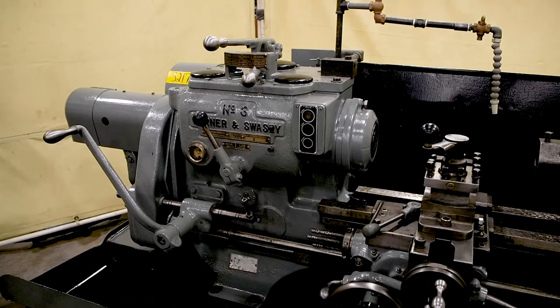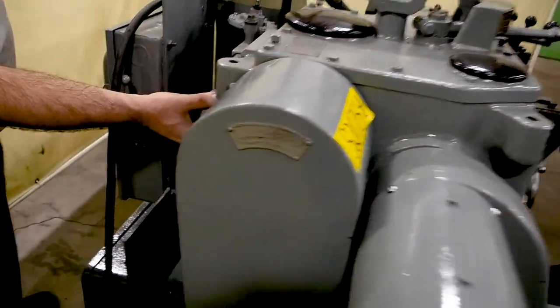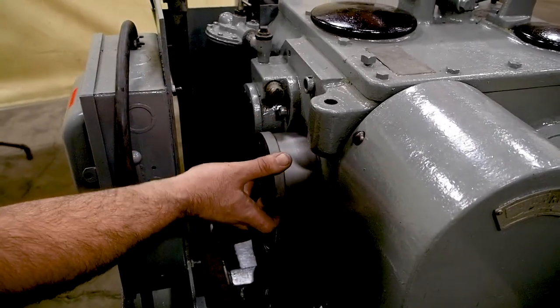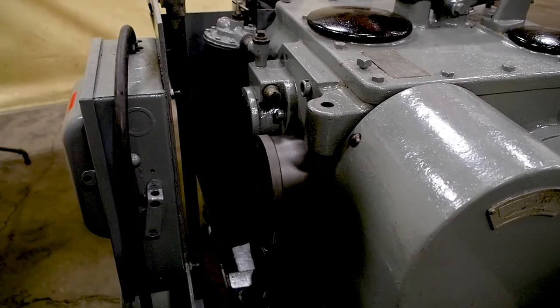If you come around to the back, the brake didn't work properly when it came in. So we took the whole brake assembly apart — the brake piston, housing — everything came off, everything was cleaned, the broken spring was replaced, and it was all put back together.